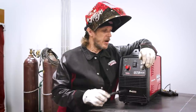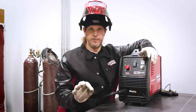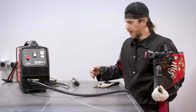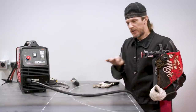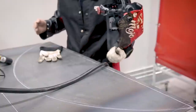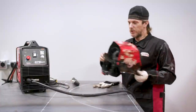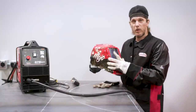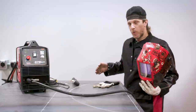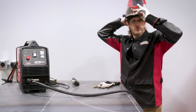I've got my carbon steel at one-eighth inch thick, machine set at about 90–95 PSI at about 17 amps. I did some preliminary cuts to check it and at that setting it cuts like butter. I've drawn out the curvature of the globe and I'm cutting freehand. I'll shape it up with a grinder to smooth out any imperfections. On long curves, don't go too slow or you'll wobble — keep a decent pace. I set the shade to about a 6 so I can see where I'm cutting. I've got soapstone underneath, which helps a lot with plasma cutting.